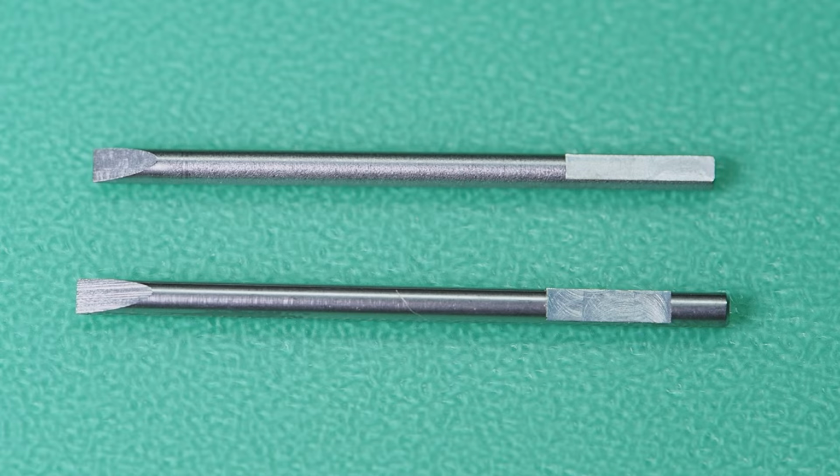The blades come loose from time to time. They won't rotate because of the flat section. The fixing screw goes against it, so they can't rotate. However, when the blade comes loose, and you lift the screwdriver, with the Bergeon blade, the fixing screw will catch on it, which is what you want. You want to lift the screwdriver, and you don't want to leave the blade behind. The Horotec one, when you lift the screwdriver, the fixing screw has nothing to catch on, and the blade can fall out and cause damage, especially if it falls on the hairspring.